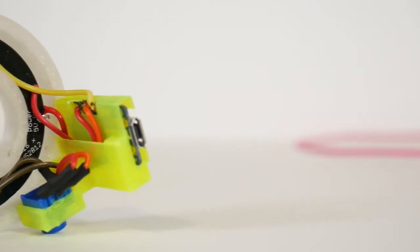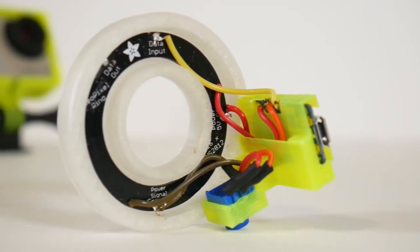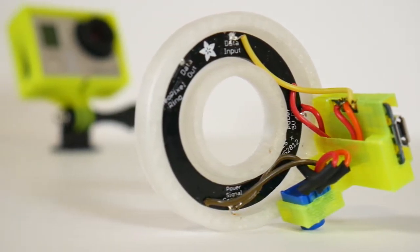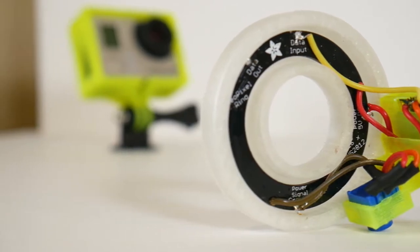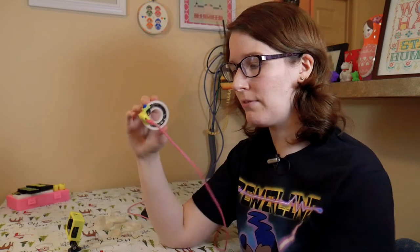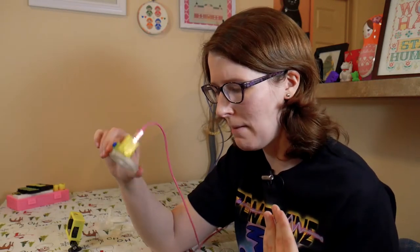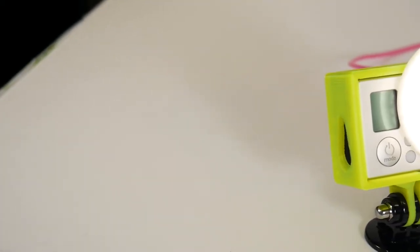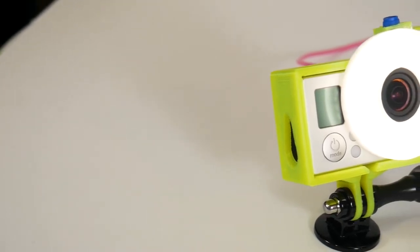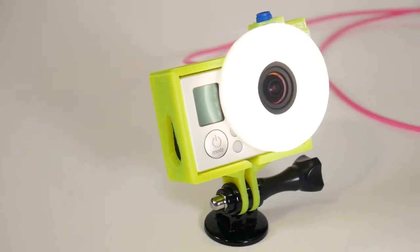For the wiring, it's really handy that the NeoPixel ring has two ground pads and two 5-volt power pads so you can daisy chain rings. What I ended up doing is running ground and 5-volt power to the potentiometer that way, so I'm only having four wires coming from the trinket, which definitely helped streamline everything. It's a really simple project, but definitely a very useful one — I actually think it might be the most useful project I've made to date.